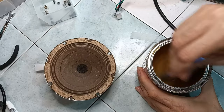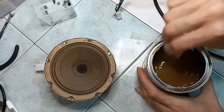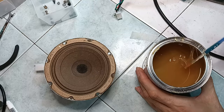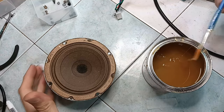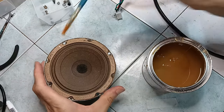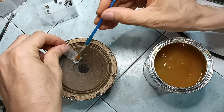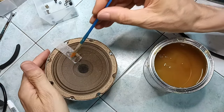Removing the loudspeaker when the front panel is still connected to the chassis is not ideal, and, unfortunately, with a wrong maneuver the cone was perforated. However, it is also true that the cone paper was already very dry and brittle, and it should have received attention before this accident.